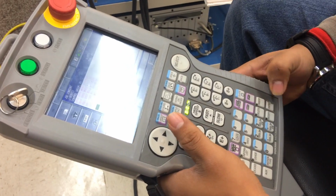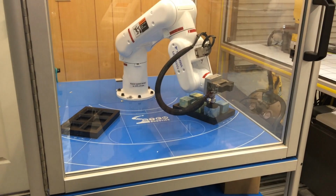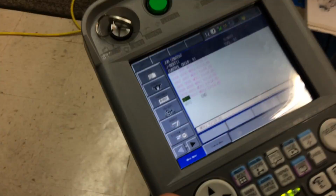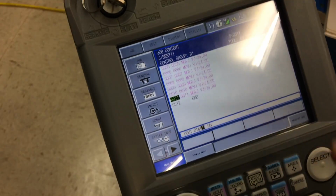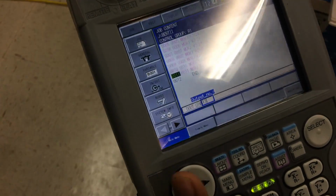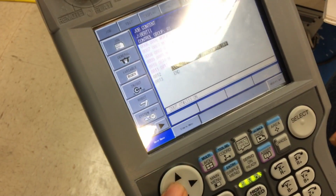Alright. As you can see, I got it in position. So now what we want to do is activate the vacuum. You'll go into your inform list right here, then press no. Your instruction manuals will tell you where it's been programmed to activate the vacuum, but in this robot we have it on 11, so go 11. We're going to press enter, and we want that thing on, so there we go. Now we're going to move it to the side.